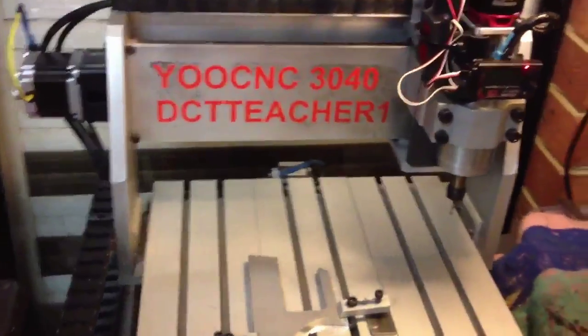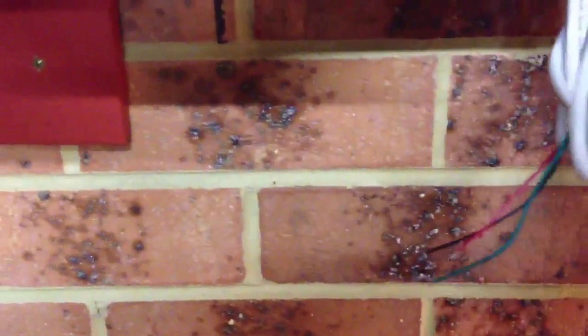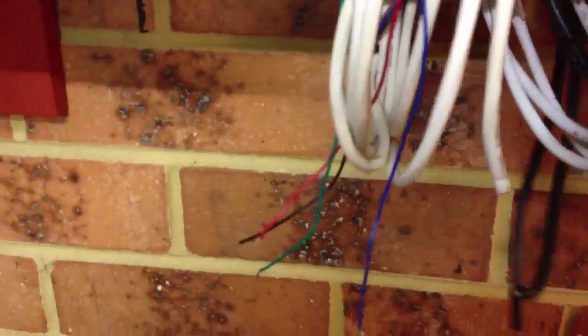I had a lot of problems with shonky wiring. The wiring they send you from China when you buy one of these things is pretty cheap, and this white stuff here — you'll find it was getting frayed. I don't know if you can see that on the video, but see that little crack in the wire. So I was getting intermittent faults in the stepper motors.